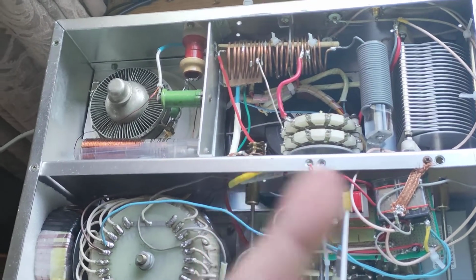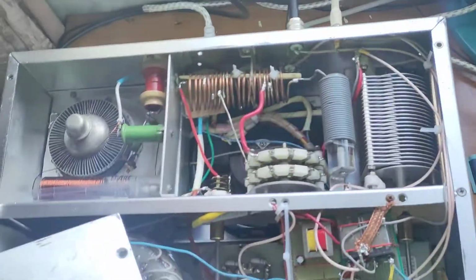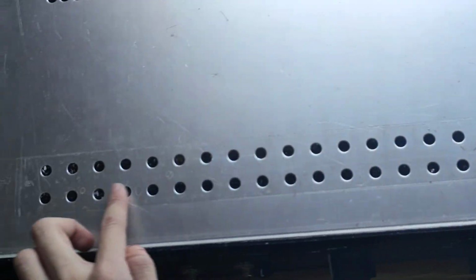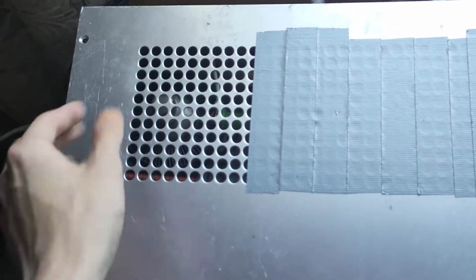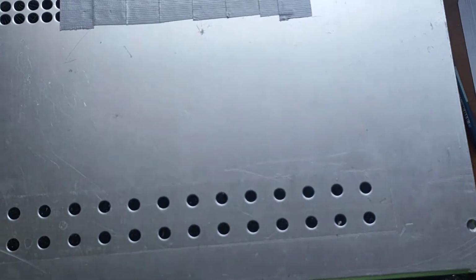the blower under here. The blower simply pressurizes the whole cavity, and you can see I use tape to cover those holes so the air only comes from this chamber, so the air blows through the radiator of the tetrode. Okay,